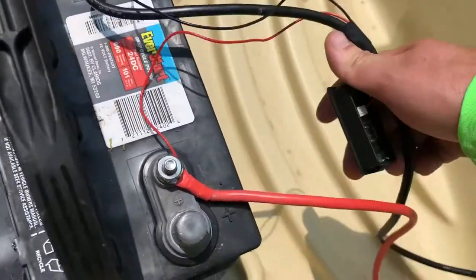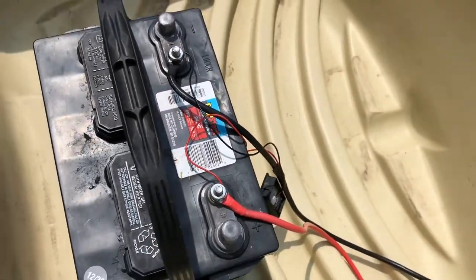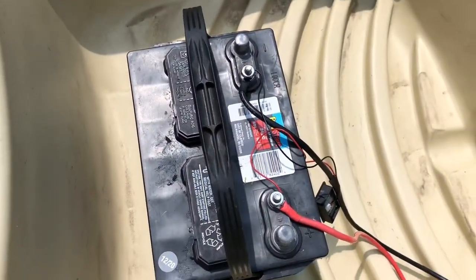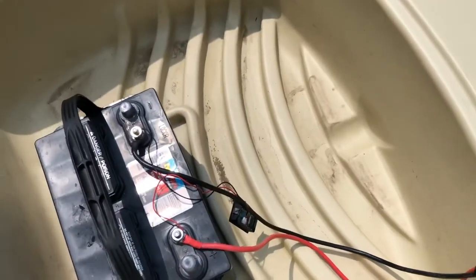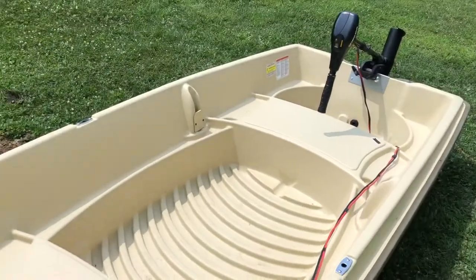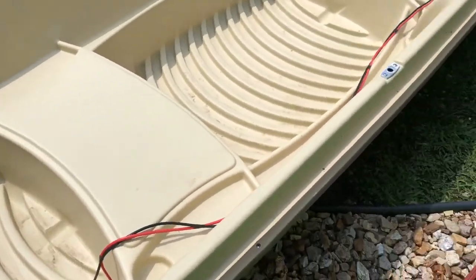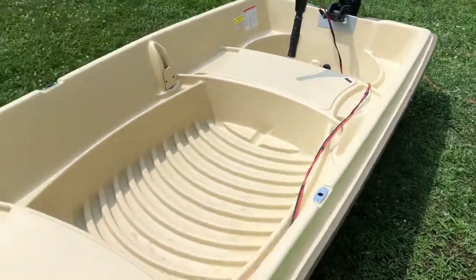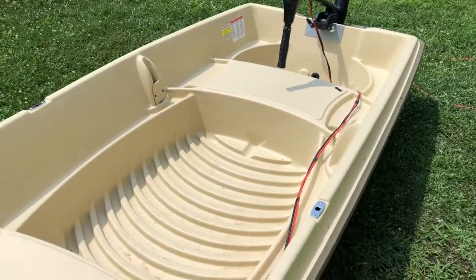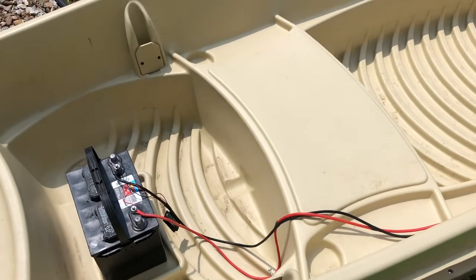This battery comes with terminals so you can connect the battery cable straight to them. I also have a battery life meter wired up as well — that's another feature you can hardwire into your trolling motor system. This extension cable gives you the opportunity to run your battery up front or in the rear. It's so portable that you could literally just pick the battery up, move it to the rear, and move your trolling motor up front or run it in the back. It's very versatile for any type of trolling motor application.